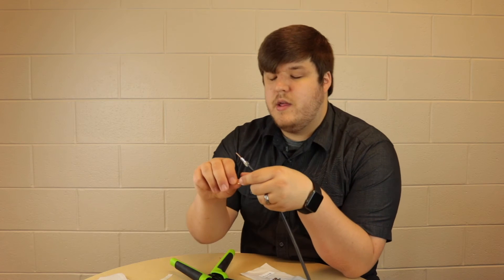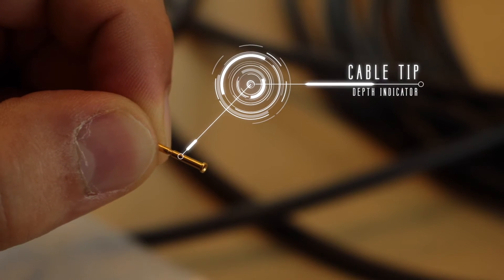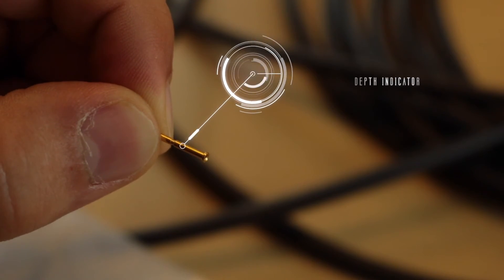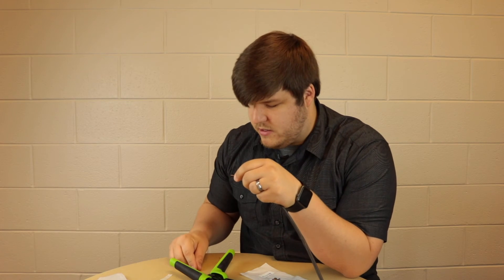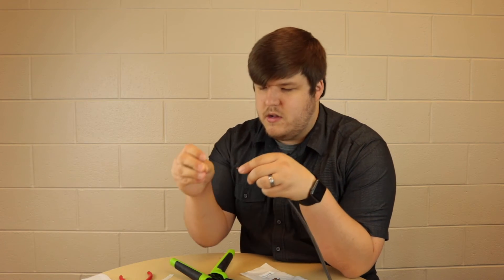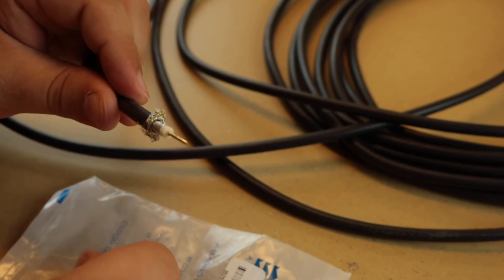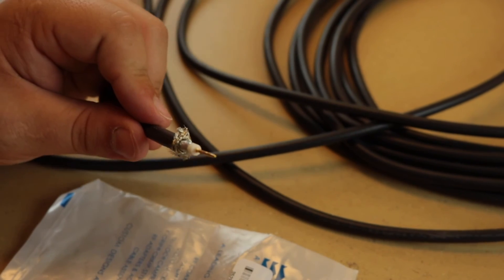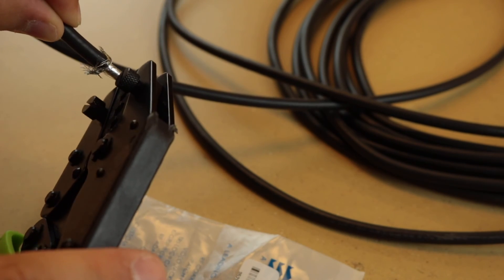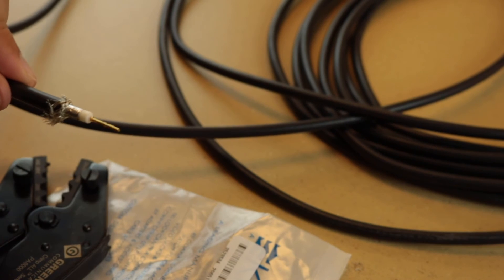Now look at your BNC tip — on the side there's a little tiny dot where you can actually see the copper cable through it once it's seated. Find out how long your center conductor should be and cut off just enough so the center conductor fits flush against the center insulated jacket, but you can still see the copper through that little hole. Grab your crimp set, use the .042 crimping section, squeeze down, and you have your center conductor pin fully crimped.